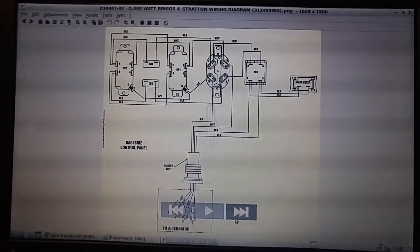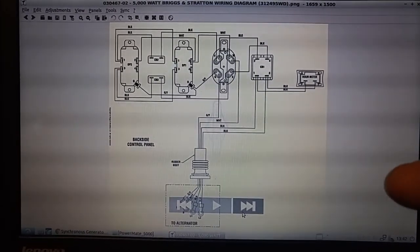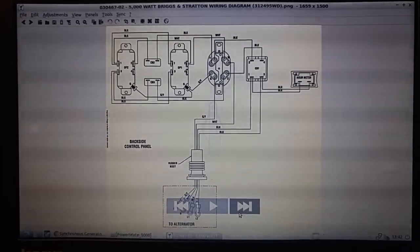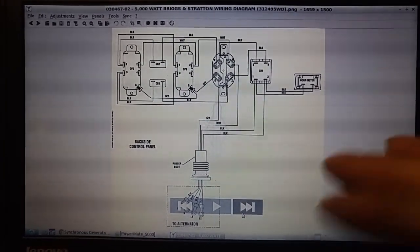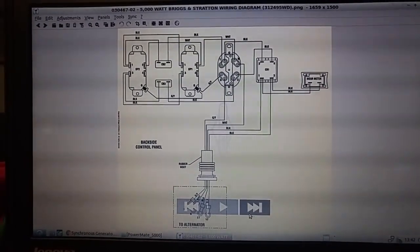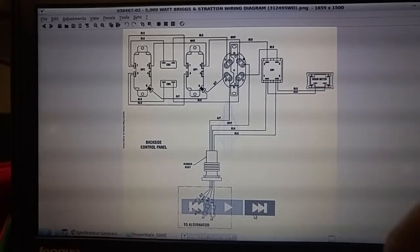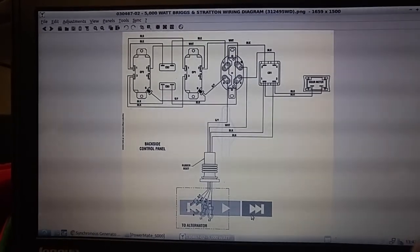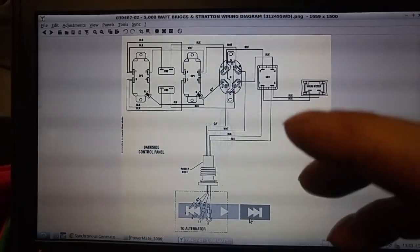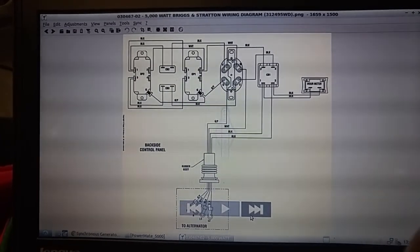I really want to understand, can I add an AVR off the shelf, or do I need to custom make an AVR? Or is that just something I don't want to think about? So I'm going to first probably wire as is, and then see how the function is, frequency and voltage wise. And if the voltage has a lot more swing based on loading, then I'll wonder if maybe I should research more about what options would be available with an AVR, but basically putting sense lines into these, which would only measure current though. I have to think about how to measure voltage off the line, so then adjust the rotor's voltage so that those windings would magnetize differently. I think that's correct.